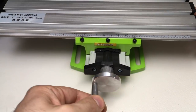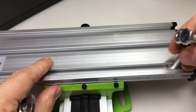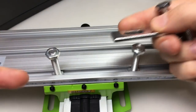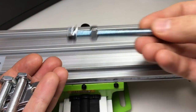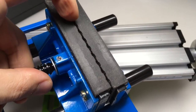The one handle moves it back and forwards. The handles come in a little box along with some bolts and plates. The bolts are 8mm and they slide in — the idea is you can attach the plates and hold down or pin down whatever it is you're going to drill, because whatever you're drilling into needs to be held very sturdily. It comes with four nuts and bolts and two plates, but you can also use longer bolts or even a drill press vise bolted to it if you want.